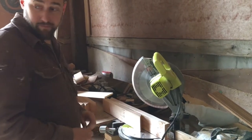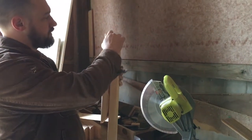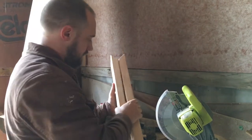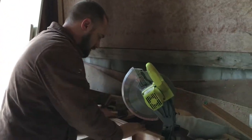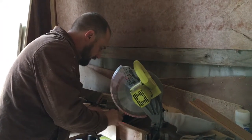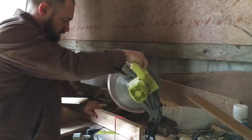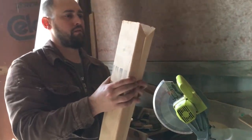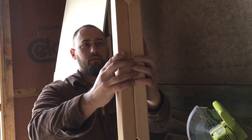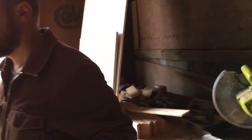So I'm making boxes for the windows. What I'm trying to do now is make two of the same pieces with 45-degree inside corners so I can make a box out of them. All I'm doing is lining up the short edge here, then lining up my laser to the other short edge on the inside of this one, and then cutting. I end up with two pieces of equal legs that are 45-degree inside corners to make boxes through the windows.